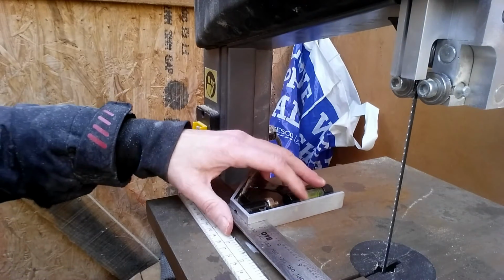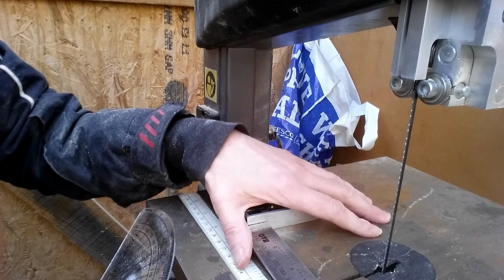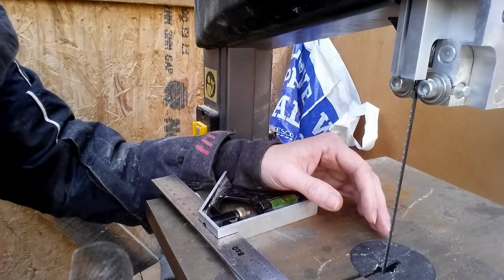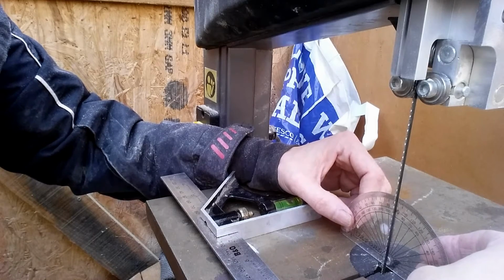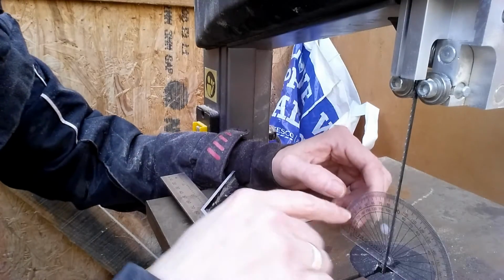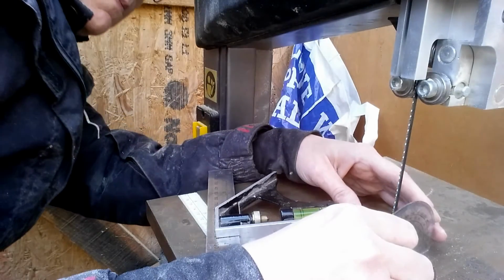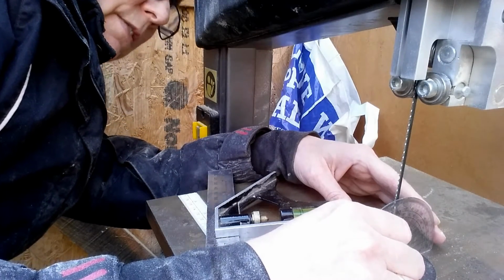Okay, moved over to the other bandsaw, and I've got a new 1/8 of an inch blade on here. Just going to check this table, because it has had problems in the past with being square, so it's really important with this one that I check all the time. I use this just to check, to make sure that it's hitting that point and the point at the bottom. Also to check for this direction, I make sure it's coming down the line in the centre.